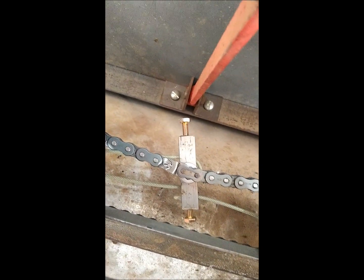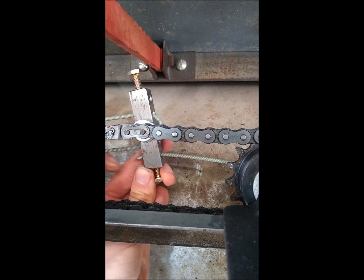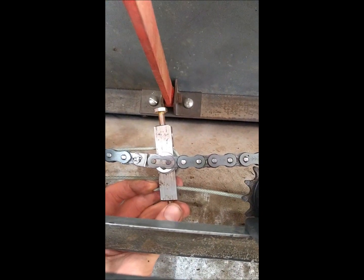Okay, I have reinstalled the brush system. I have started threading it with the new cable. I start by locking in one end of the cable there into the cable block with the bolt, and then I thread it through the bottom brush, and then I come back around. I make a loop through the two holes in the cable block. I don't know if you can see it there. It comes in this side after going through this side and up through the bottom screen on the shoe. It then comes in from this side and then comes in to the next hole on the block, makes a loop, goes back out the other one, and now I've got it here.